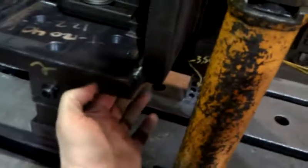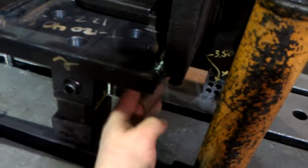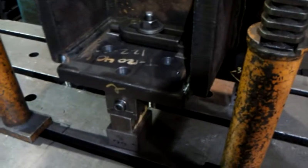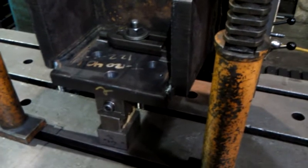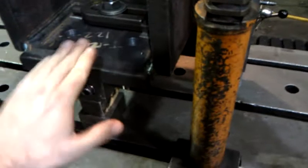The first setup was this side facing the machine, and I set it on one, two, three blocks stacked up. But because the table's not entirely flat, once you put the three blocks in there it was still out a little bit, so I used an Ingersoll jack to bring this back end in straight.